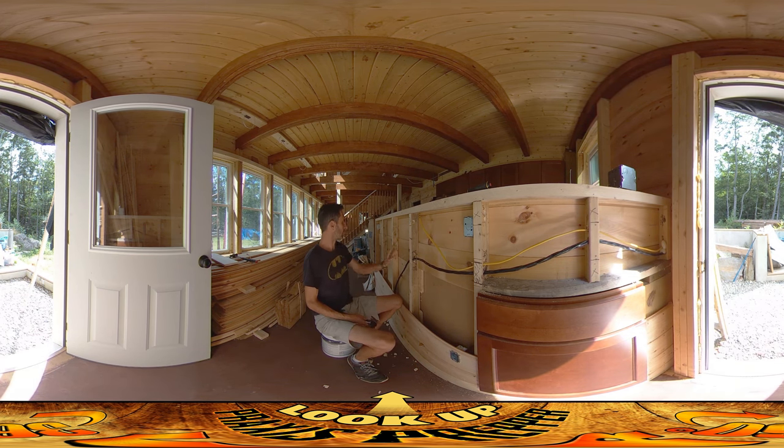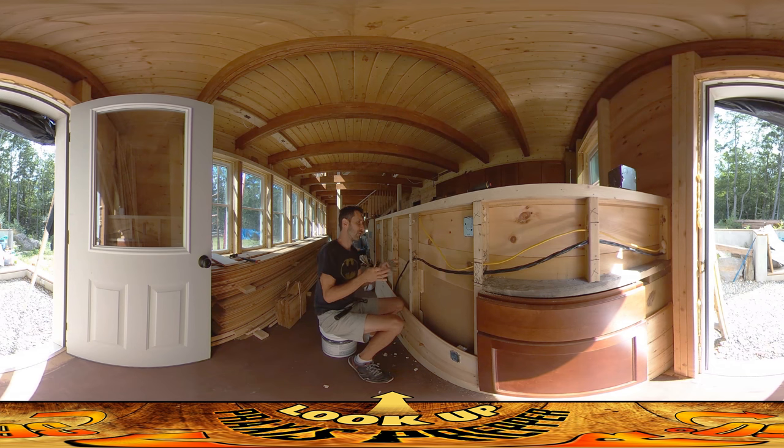What I've been working on while waiting is these nailers — little metal plates that are going to go over any spots where wires are passing close to the surface. We've got two-by-fours here, but they've been cut down to three inches instead of the normal three and a half inches to make this partition mini-wall a little thinner. Because of that, when running wires through the middle, they're too close to one of the surfaces. The metal plates protect the wires so if anyone in the future wants to pop nails into this wall, they can't put a nail through a wire.